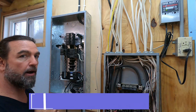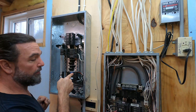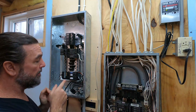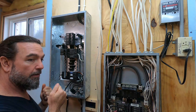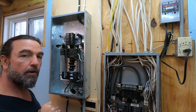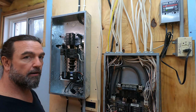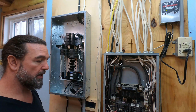If the inverters do route the ground out to that grounding rod, then in theory when I connect that ground screw from the floating neutral bus bar to the backside of that case, you should see amps on that ground — and I don't. I'm probably going to disconnect it, but I don't want to disconnect it unless I'm absolutely sure those inverters will actually route the ground in the case of a fault out through all the components and actually ground properly. Hopefully some professionals can weigh in and give a bit more insight for those of us doing sub panels with solar systems connecting to the grid.